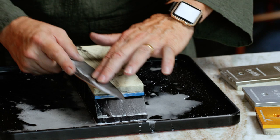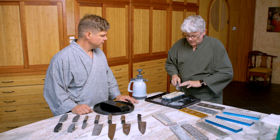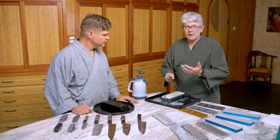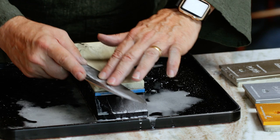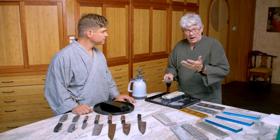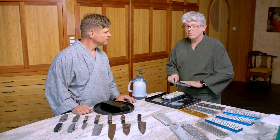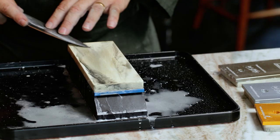For people who are just learning this technique, I would recommend only using trailing edge strokes — so I'm trailing the edge over the surface of the stone. Once you get better, going both directions is fine, but when you're just learning these motions, your body's going to want to move all over the place, so my recommendation would be to simply use trailing edge strokes. We also call that stropping. Imagine that is a piece of leather, not a stone — you would never push the edge into the leather, you're always going to drag over it. Stropping on the stone is a little slower, but it's a whole lot more consistent.